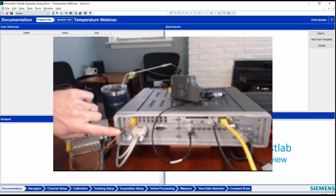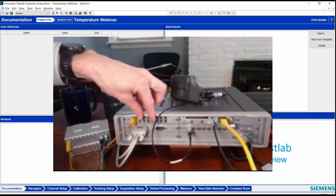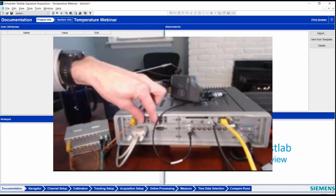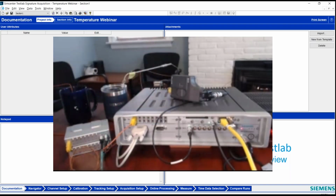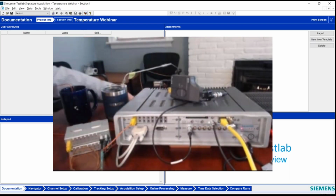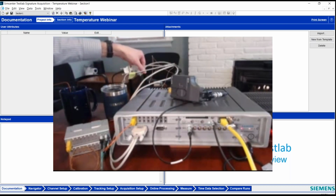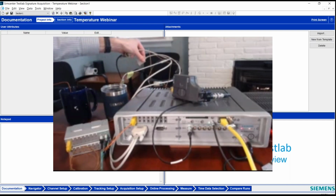First, you'll see that down here in the front end, I have one of these CAN 4 or CN4 modules that I talked about. And you'll see one thing right away is that, well, Jason, you said it's a CAN 4 and there's 2 DB9 connectors. How can you get 4 CAN buses out of that? Even people that have bought these from us in the past forget that we send this interesting cable here, which splits out into 2 different DB9s. So really that 9-pin connector is wired such that you can hook up 2 different CAN buses.